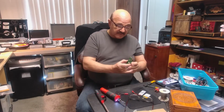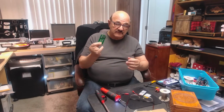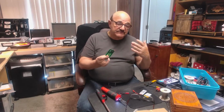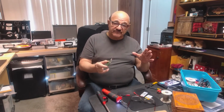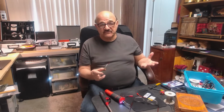So basically what I'm telling you to do, if you own the Hugo Shelley Insight Pro and you haven't used it in a while, or you just bought it because it was new old stock, or because somebody was selling it with the cards, is just test it out, make sure it works, and then charge it up fully overnight. And then the next day, run it. See if it runs for an hour, 45 minutes, or 30 minutes.